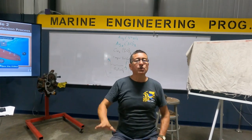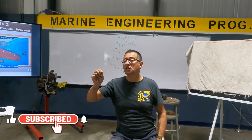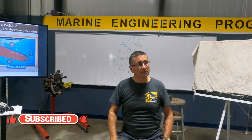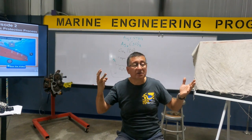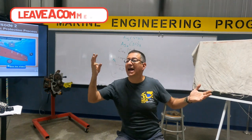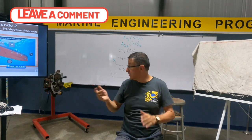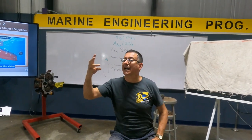Pay attention. When you talk about double phase equipment, you connect hot, hot and ground. Ground is the reference. When you connect three phase motors, three phase equipment — heavy motors, heavy compressors in shops — hot, hot, hot and ground. No neutral. The neutral is exclusive for single phase installation. In the outlet on the wall, you have hot, neutral and ground.